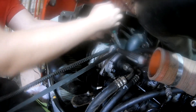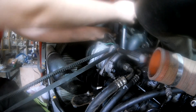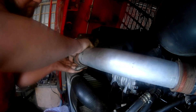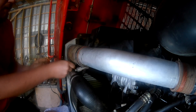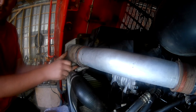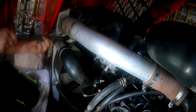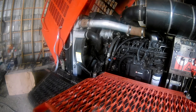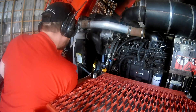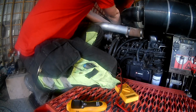The fan needed to be a little further in so I had to readjust the angle on the hoses going from it. I was a little worried that undoing one could pull and change the other — had to loosen a little and twist a few degrees. Then the intake pipe went back on and it was time to start it.